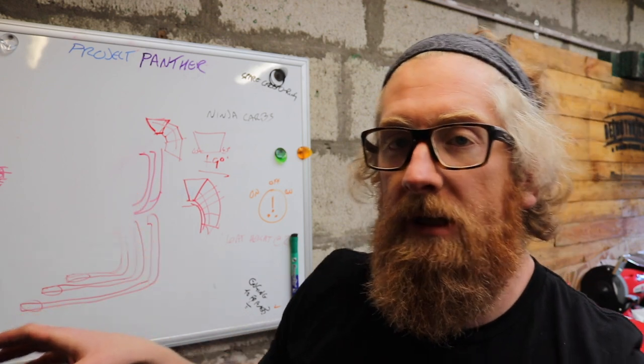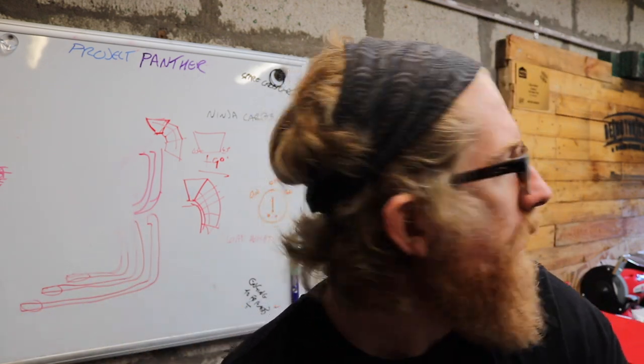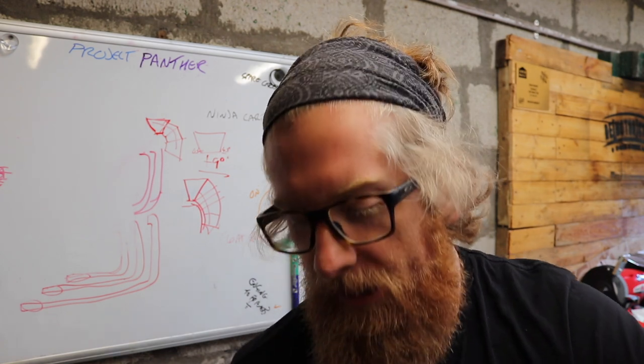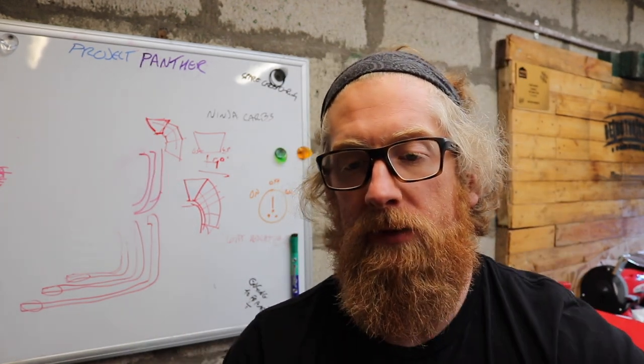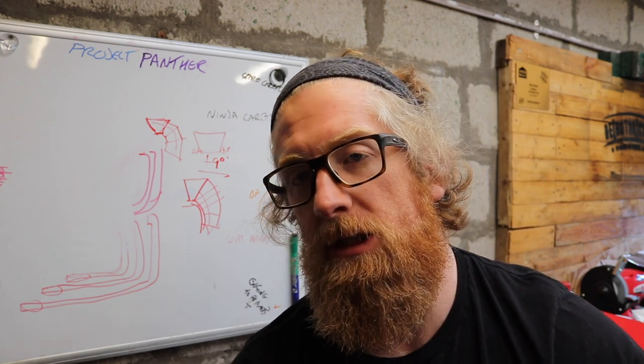If it's 4.5 degrees to get a 90 degree transition, and I've got 2 per exhaust section, then that's what, 60. Quite a lot of pie cuts I need to go and make. So once I nail down what my bend radius is going to be, I'll keep that fixed. I don't really see the need in changing it.